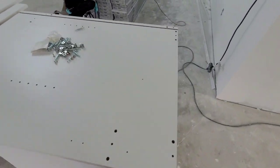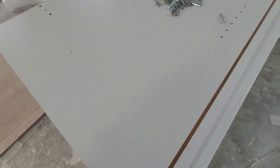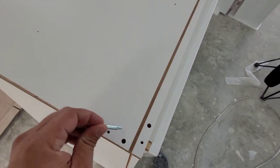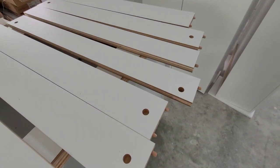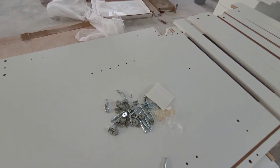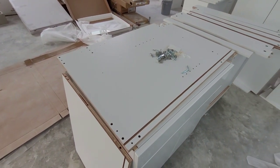That is the bottom plate there, that's the back piece. I'm going to leave the drawers in the box, and this is all the hardware for the drawers. These cabinets are put together with these twist pieces - all of these go in the smaller holes, so you're going to put one here, one here, all the way around the cabinet. The dowels are going to go in the bigger holes, which the dowels are already installed on all those cross pieces and the bottom piece.